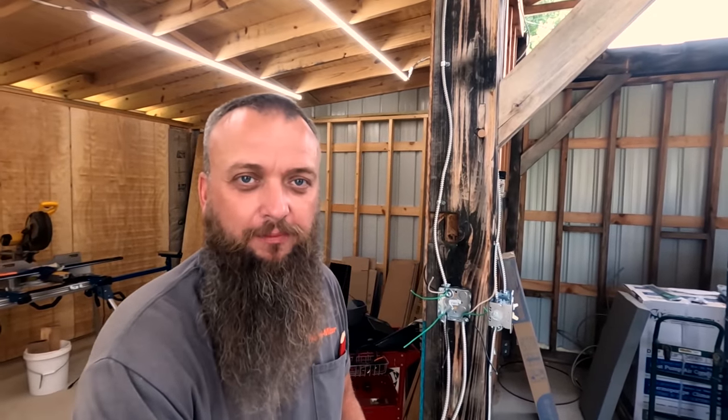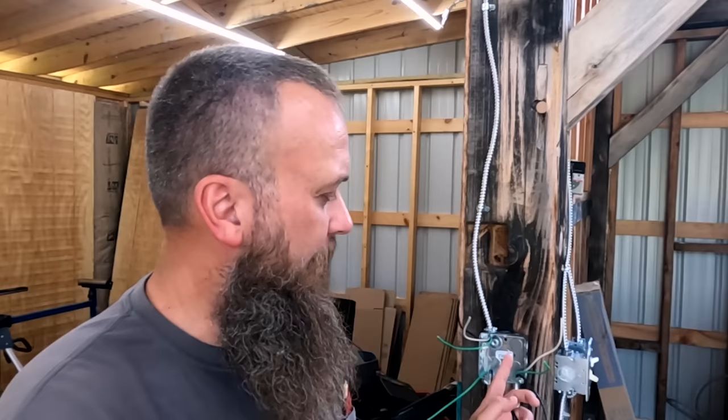Now we're going to move over and do some electrical. I need to do a junction box right here because I'm running two outlets off of one breaker. I know you guys are probably typing in the comments right now about how my electrical work isn't as good as yours - well, it's good enough for me and I've never had a fire. What I'm doing here is trying to conserve wire because wire is so expensive. I've already got one circuit of number 10 wire run over here for the planer. I need to come off this circuit and put another outlet for the table saw. I'm never going to run those two tools at the same time, so running a separate circuit would be a waste of wire and money. So I'm putting a junction box right here and coming off the bottom of that with two 220 outlets - one for the planer, one for the table saw.